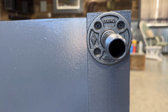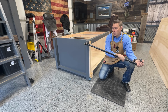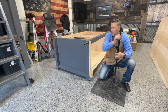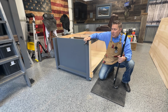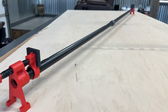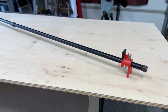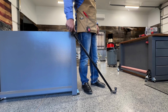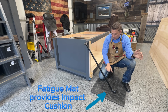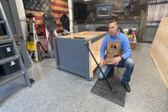But hey, the first option, guys, this is super simple, and there's a lot of pros to this one. Very robust. This is simply 3/4 inch plywood. This is removable, simply take the cap, it comes off, and I'm gonna show you a little bit more later. But this is an on and off that allows you to keep this on and use this as a hanger slash hook, which I actually really like. And secret, these 3/4 inch pipes are simply the extensions that I use for my pipe clamps up top, which you can never have enough of. So it's kind of got a dual purpose. So very robust with little angle iron at the bottom to allow you to hook the plywood, as opposed to, once it's off, you've got this swing arm, which is a little bit more low profile.